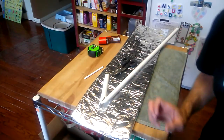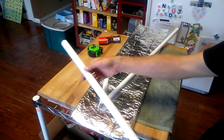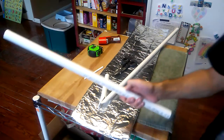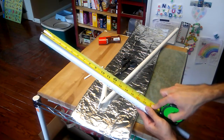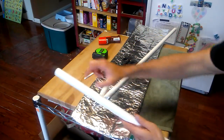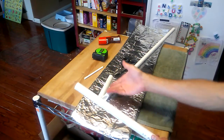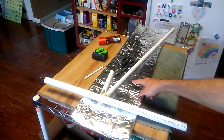For the handle, we're going to take a ¾-inch section of PVC. I'm going to chop about 6 inches off so it's the same size as the replica version you can buy online. The measured length is 17 inches. When you flatten it and shape it, the overall length should be about 16 inches end to end. We're going to cut a hole or slot to insert the haft — the haft will be sort of wrapped around it. I'm going to go ahead and cut this one off now and then we'll flatten them.